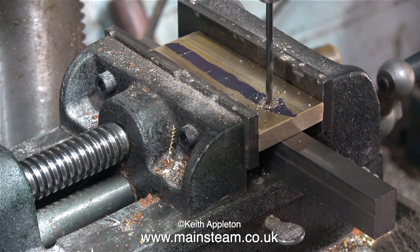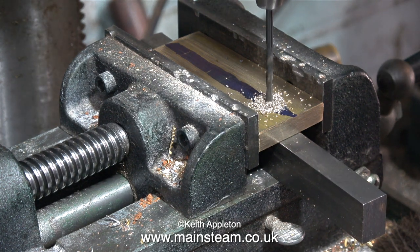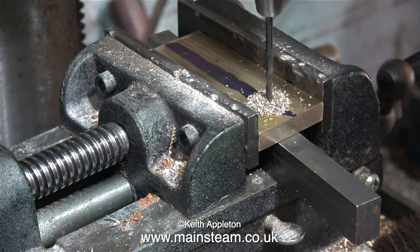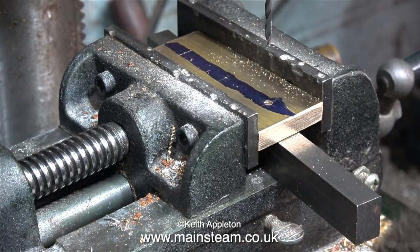Over to the drilling machine now — it's time to drill the holes, and here's another top tip. This drill size is smaller than the one I'm finally going to use. I thought I would use this small drill first, and just in case I drill the holes in the wrong place I can then use a needle file to open up the holes into the correct place before drilling them the size I want to clear the M5 bolts.